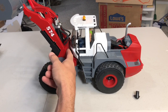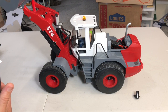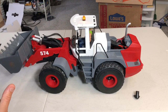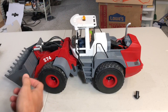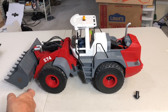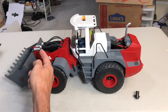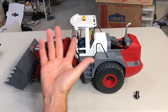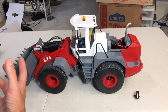It would take quite a bit to rip that body front pin off the top, because it's also mounted through the bottom by screws. On your downward throw, same way — I've got mine set up so the curl up is to the left. You want to adjust it so you're at 100% curl up but you can barely hear it touching — that's maximum curl for this machine's stock design. You don't want to overthrow it because all you'll do is throw these rods out too far, bind the hole up, and damage it, since it can't do more than what the machine is designed to do.